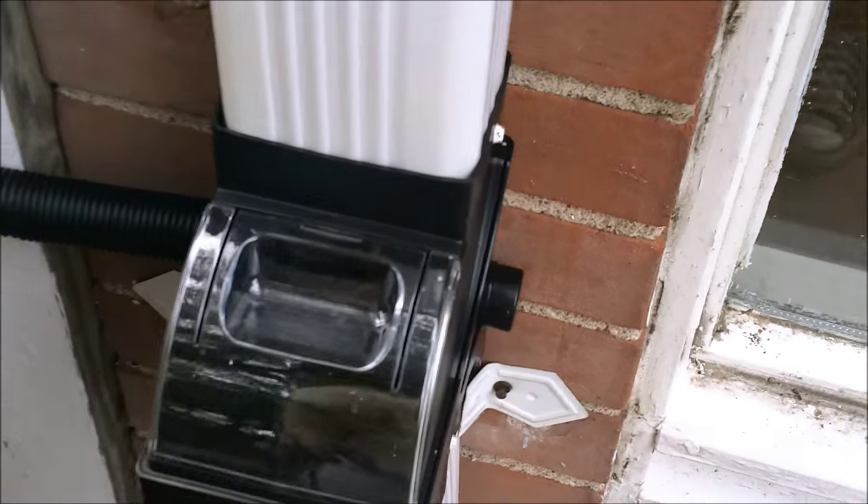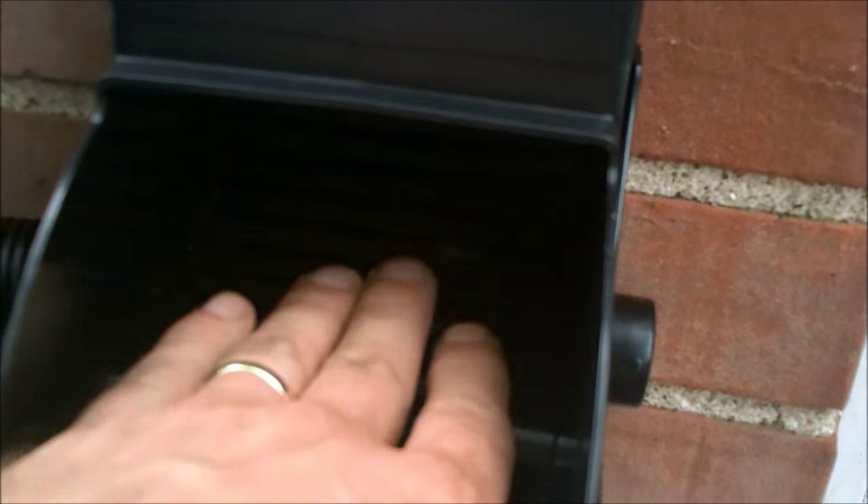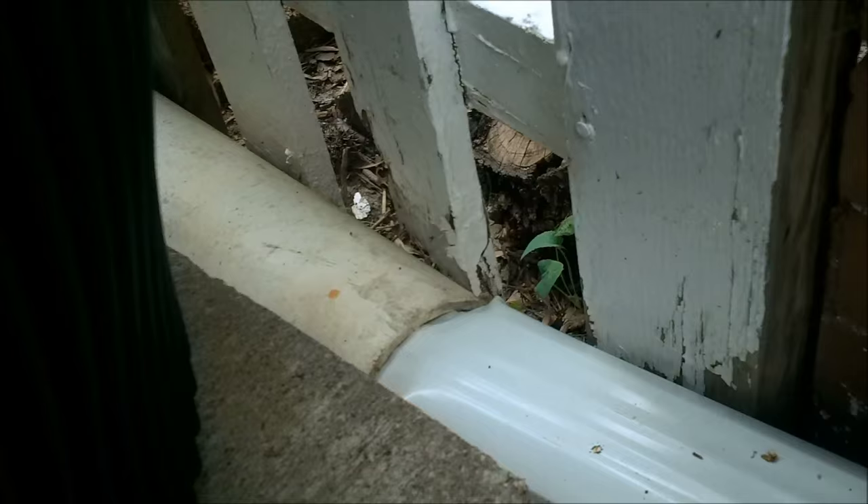So we had to buy this thing, which is called a diverter. Inside of it is a mechanism that guarantees that if there's water up to the height of the hose, then that fills this pool right in here, and the gutter water then pours over down into the proper gutter as it used to be. There's a happy place for the water to go, and I can get the water away from the house. So that's a completed system right there.